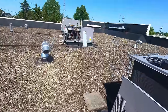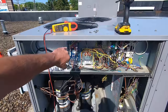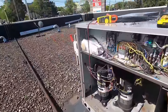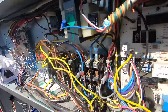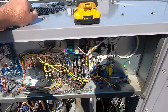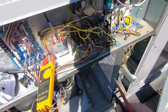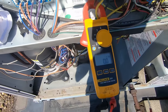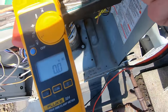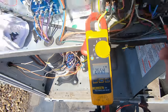I opened up all three units - of course it's the last one. I believe we've got a blown fuse or something. I've got no 24 volts at the control board. It's 460V and we'll do some testing. My 5 amp fuse is not tripped on the transformer, so let me check some voltages. Yeah, I'm missing a leg - I should have 460 between each leg and I don't. I have zero, 265, 265.